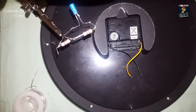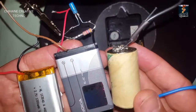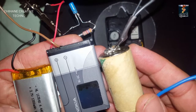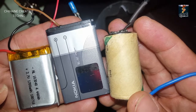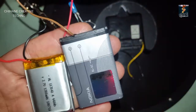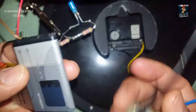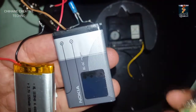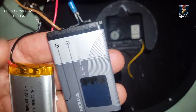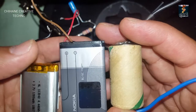You can use any sort of battery as long as it's 3.5 to 3.7 volts and rechargeable. You can use your old mobile phone battery — this one, or this one, or a standard lithium one. They all just need to be rechargeable lithium batteries at around 3.7 volts.